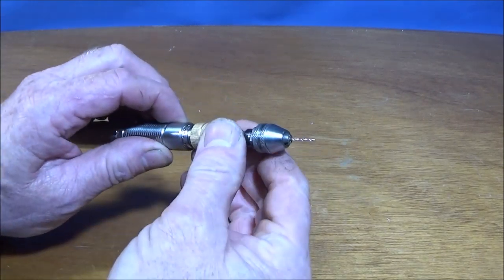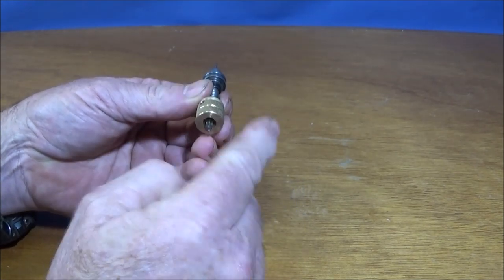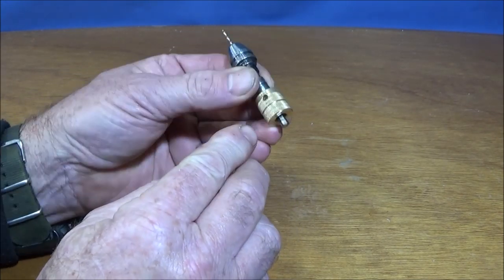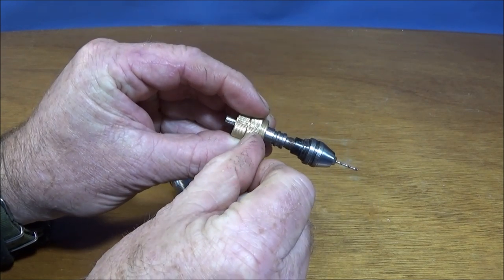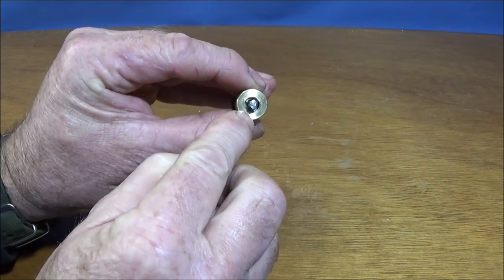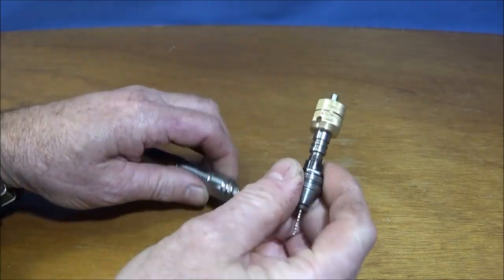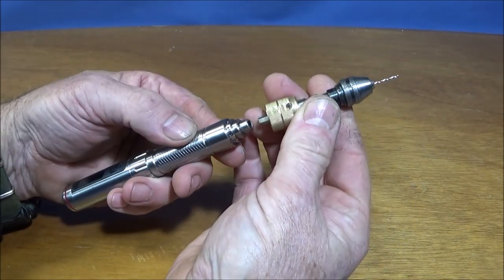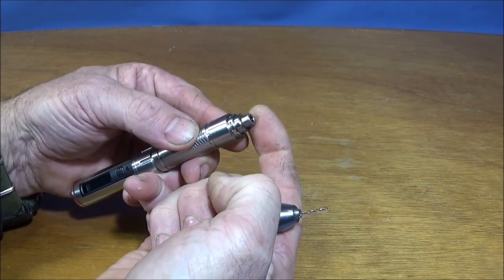So that was the basic operations to make this pin chuck assembly up. I didn't show it all on the boring. When the spindle pushes into this one, it goes up roughly around halfway, and then this end here is bored out down to that bore, so that when it goes onto the screwdriver, it actually goes over the collar here.